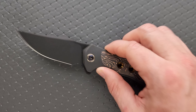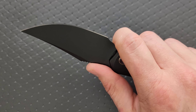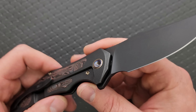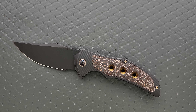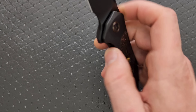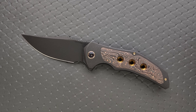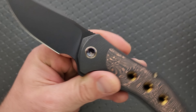That's what makes it stand out — that's what makes it feel special. And for what they want for this, it needs to feel special. It cuts, it slices, the edge is symmetrical, the final apex looks really nice with no nicks or rolls. CPM 20CV — they run it at 59 to 61, or 58 to 60 if coated. Everybody's heard this is too low. 20CV, M390, and 204P are all the same steel made by different companies — Crucible for 20CV, Carpenter for 204P, and Böhler for M390. It has the same optimal range. For production knives, I want to see it at 60 to 62. The blade finish — WeKnives, if you guys are able to do this for the whole blade, this would have looked way, way cooler.